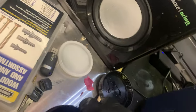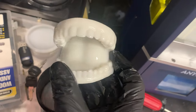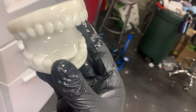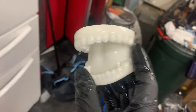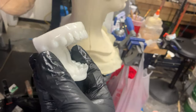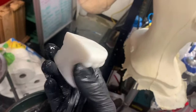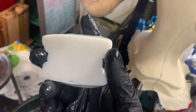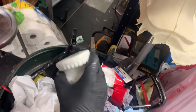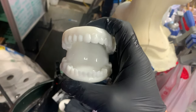I have not really even taken a look yet. Oh yeah, that's pretty cool. What I did was I modeled that tongue — you can see it in there. This is still wet from the alcohol, that's why it's sort of shiny and kind of slick looking. What you do is take it and set it in front of a Halloween UV light, and that further cures the resin. I probably ought to hollow this thing out because there's probably a lot of unused and uncured resin in there — it's a waste of resin, quite frankly.